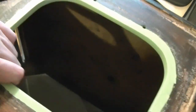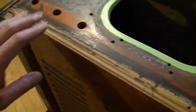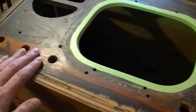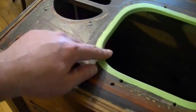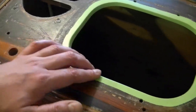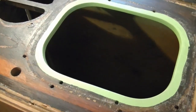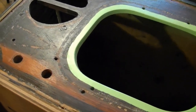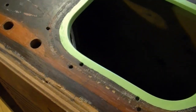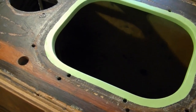But before I get too caught up in that, I'm going to deal with some other stuff. Namely, right now, I got off the remains of my burlap grill cloth, and now I want to sand this down with some really coarse sandpaper to get the glue residue off, and I want to go over this, not with as coarse, maybe 220 grit, not so much to take all this green paint off, but to prepare it to accept some fresh paint. So with the surface so smooth, I don't know if the new paint would adhere so well, and I'll be using Navajo white this time.